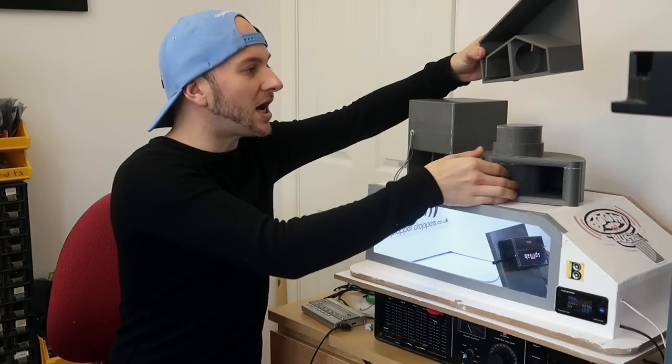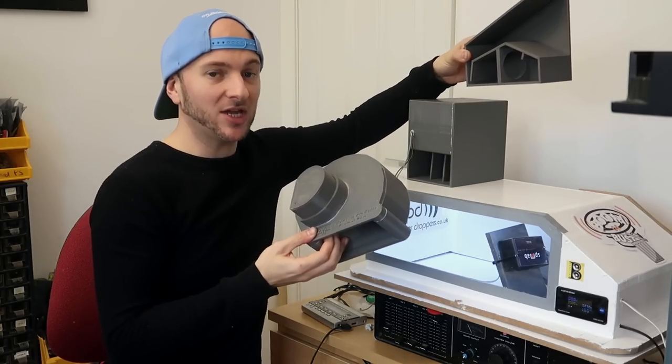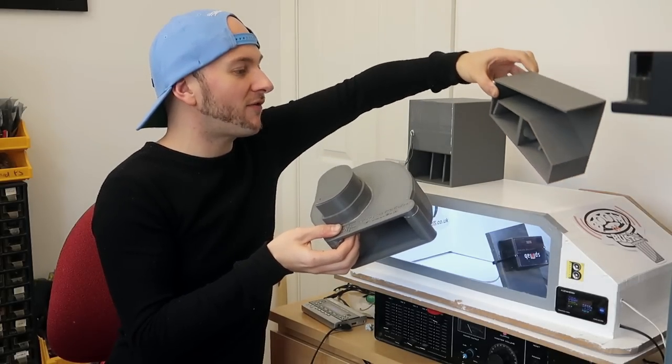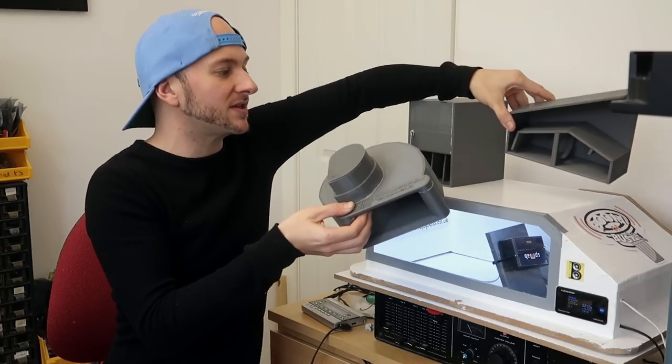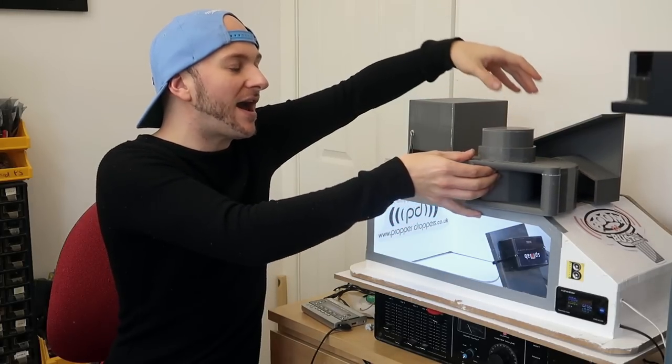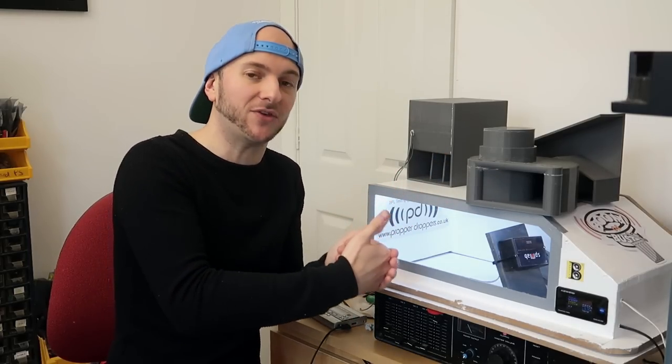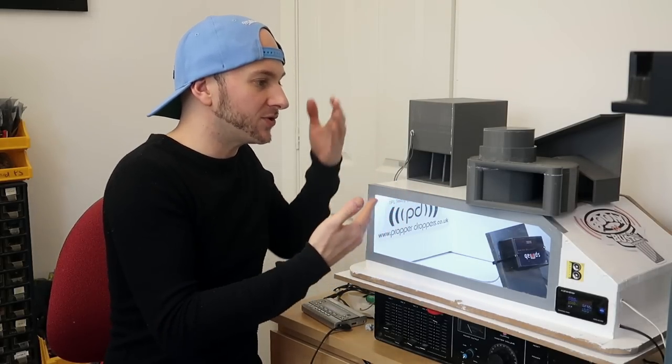Now, these other two enclosures, which are ahead of the Tuba HT with the door closed, use just the sealed chamber mostly to produce those lower frequencies, and the horns are shorter, therefore will probably help out on the higher frequencies more so than the Tuba HT. That may also have something to do with why they are louder with the door closed, but I'm not entirely sure. One thing we could do at the end of this season is retest the top five enclosures with a much more consistent door seal method, just to confirm whether there's actually any differences in the box design being louder with the door open versus closed, or whether it was just variance in the testing.